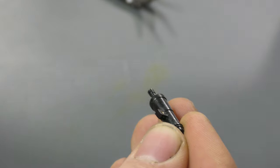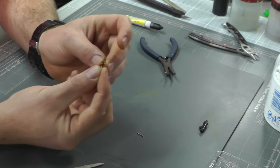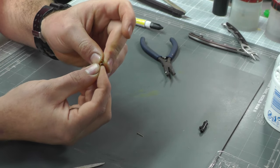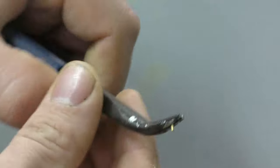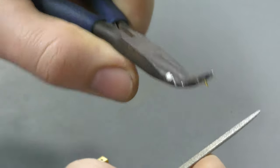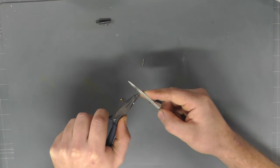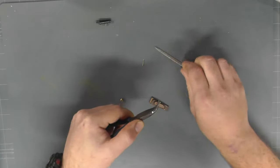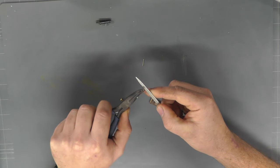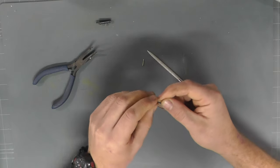Another tip: we've cut our little brass rod that goes through there. Get some pliers, hold it nice and tight, and then you can sand the ends off. It's a nice easy way of holding something really small and flimsy. We can sand them off to make them nice and straight, because when you cut them with pliers they tend to end up with a nasty shape to them. Hold them nice and tight and they'll sand nice and flat.